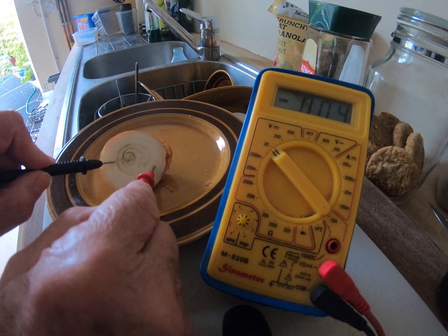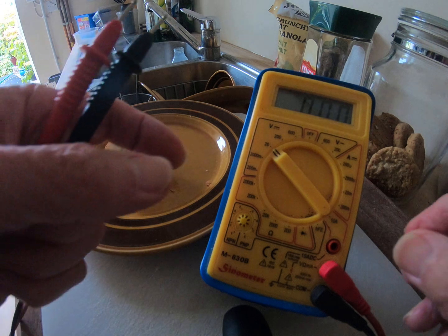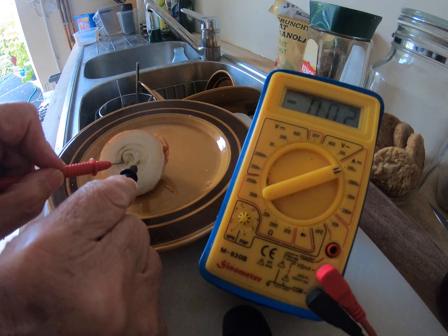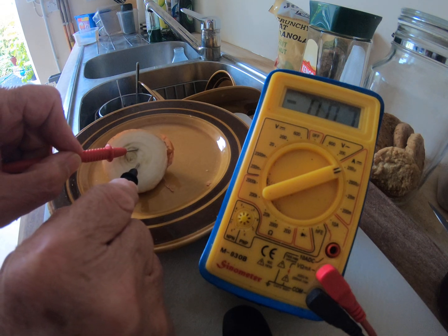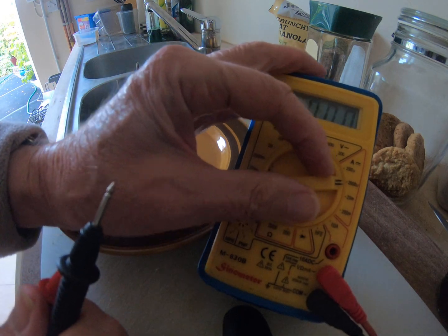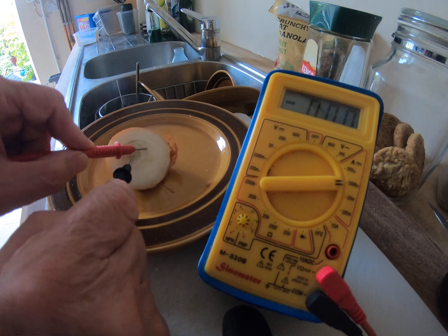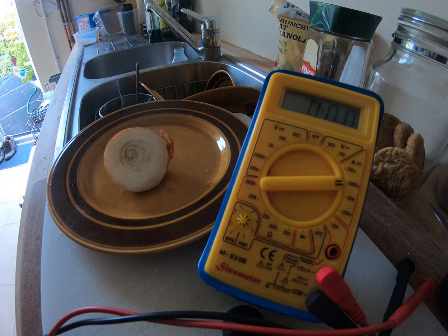This is always negative — notice it's the same metals; we haven't got copper and zinc or anything like that, the old trick with that. But there we go, voltage. Then if we put it on to the micro-amps range, let's see if any current comes flying out. We've got less than a micro-amp, which is a really pathetic amount of current — 0.42 micro-amps. So whether you can light a light bulb with that level of current is a bit dodgy, but voltage — no problem.